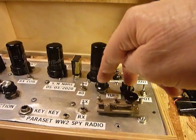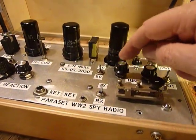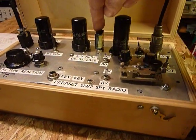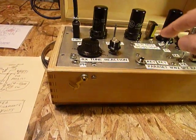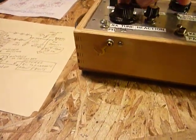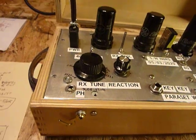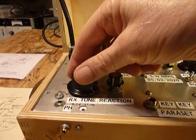You'll notice I've got two knobs here — the variable capacitor I eliminated is still under there but doesn't do anything. The one that tunes is over here, so you only need one capacitor when you put that link in. The toroid worked great. Here's my crystal — I ground that one myself for 3552 kilohertz, because I've got a good friend in Mishawaka, Dan, who gets on that frequency working CW, and he was the first guy I worked with this paraset. This is a trimmer capacitor out of an old car radio — it turns many turns, giving very slow tuning.